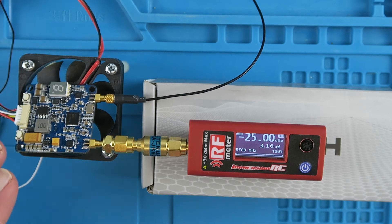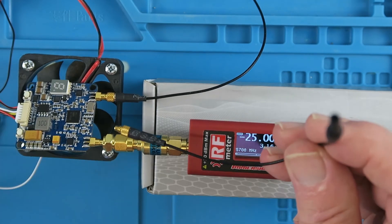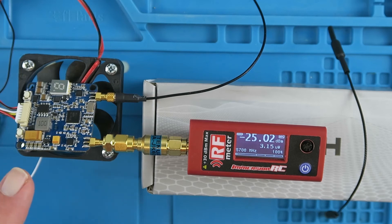One thing that's lacking is that it doesn't support the smart audio function — you have to set the power level and channels using the buttons. But I don't see that being a huge limitation. Clearly the benefit is having the two antennas and being able to position them at different orientations. Probably starting at 90 degrees and experimenting from there. All in all, a nice little board with the interesting possibility of the two antennas, probably mainly of use in long-range testing or perhaps more suited to the fixed-wing environment.